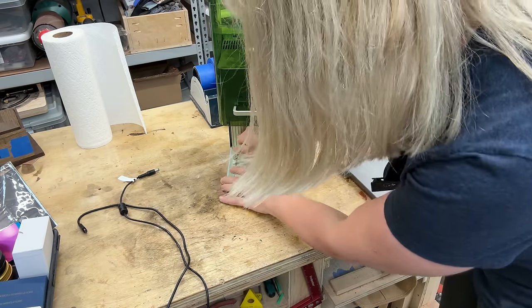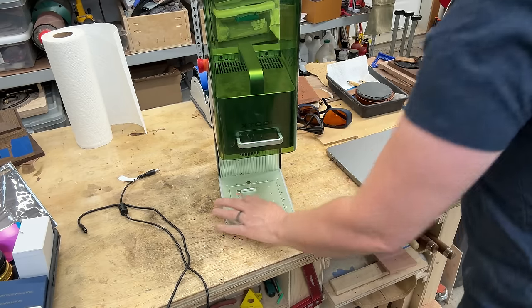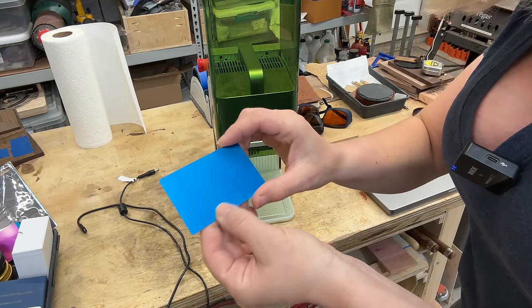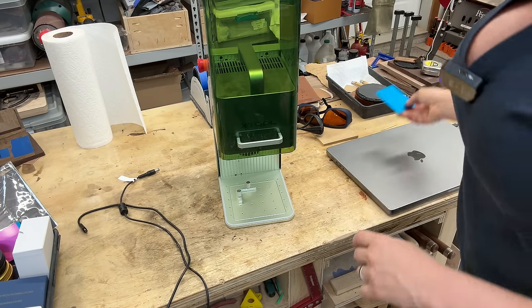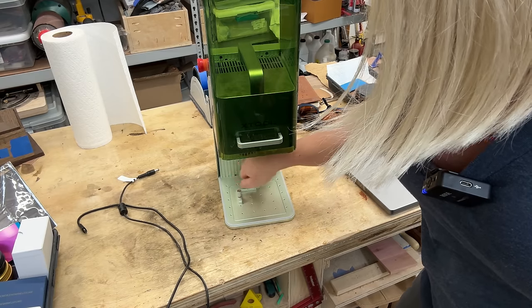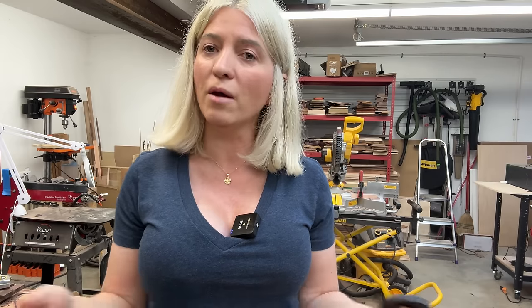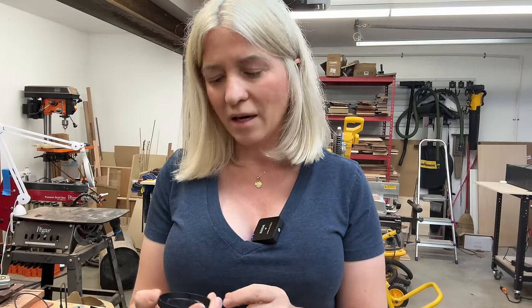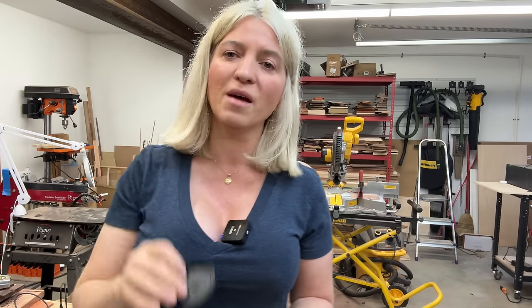Inside, you get positioning pins that screw into the holes on the plate — these make repeatable work super easy to align. So if I'm engraving business cards, I can always place the card on that reference and make sure it gets centered every single time. One important thing: the machine comes with a cap on the laser — make sure you remove it. I didn't know I had a cap, kept increasing the power, and got an alarm saying the machine detected fire. I was almost putting a hole through the cap. The safety alarms do work — but remove the cap before you use the laser.